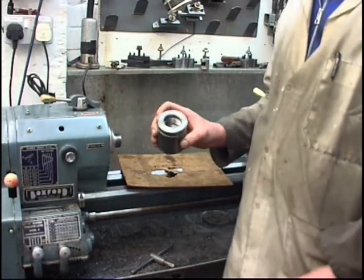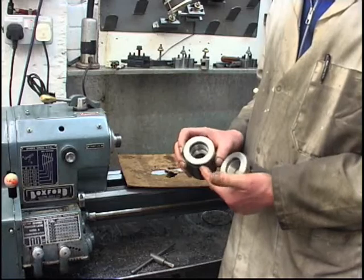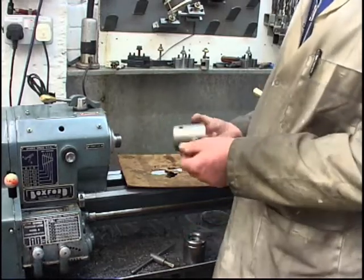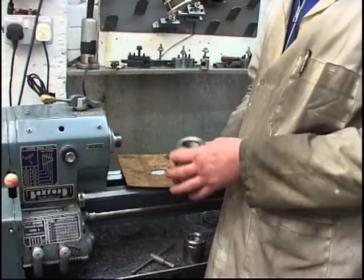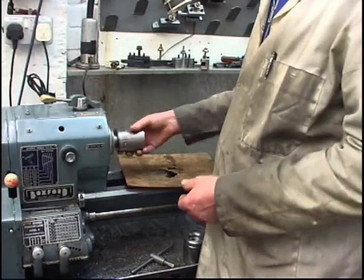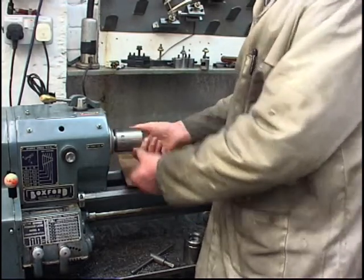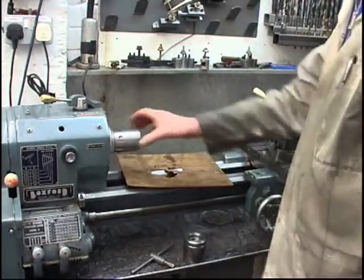That's the one I made with the wrong thread — well, it's the right thread but it's slightly wrong inside. It does go on. So what I did last night, I made another one. I've done a bit more machining on it, which I did video of, but I cut the thread with no camera running, concentrated on what I was doing, and got it right. Exactly the same procedure, just had the compound at the right angle. It's actually a better fit. The screws are nice. I'm very happy with that.